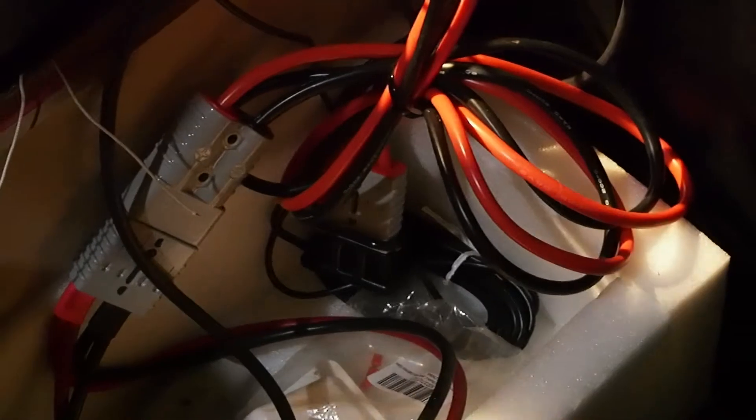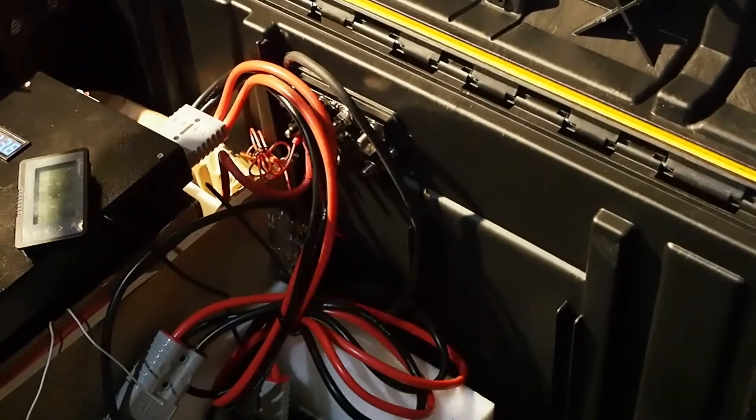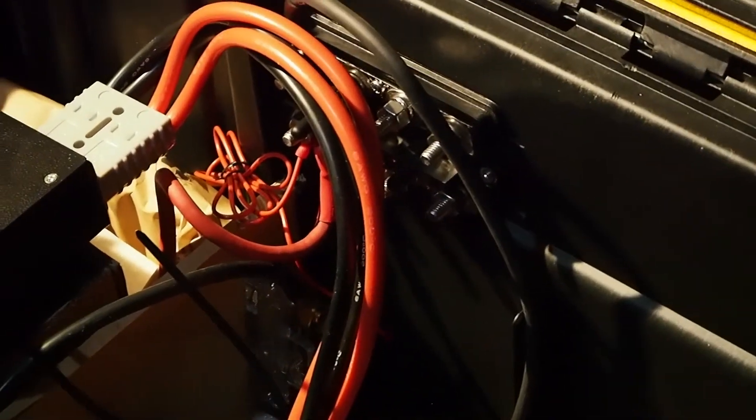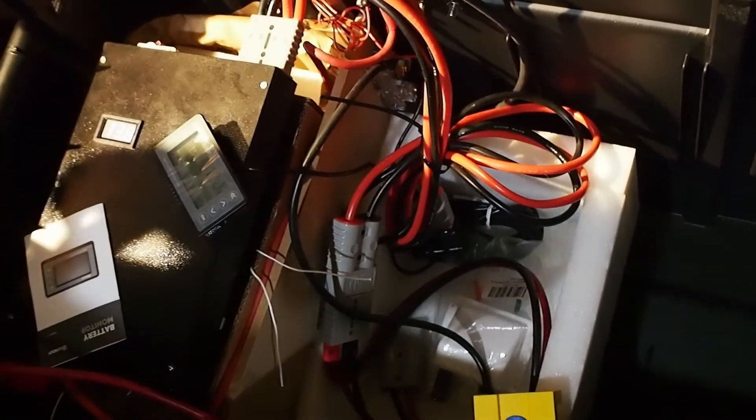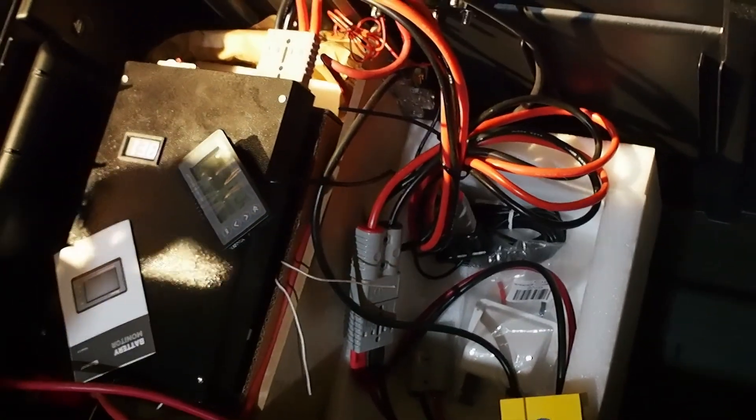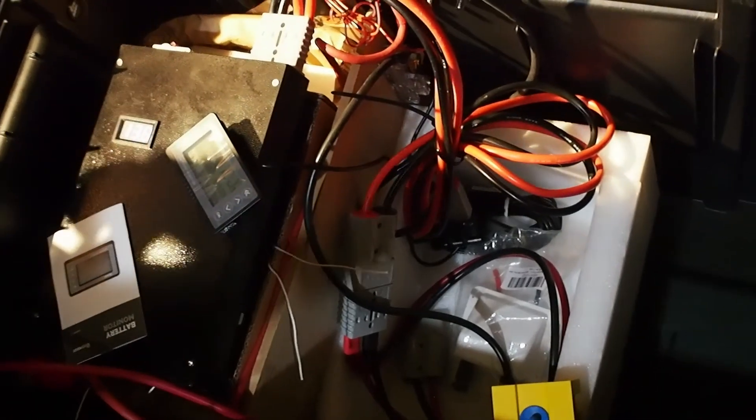That's all we wanted to do — explain how we have the bus bar active now. The battery is active and going to a master switch, so we have total control of the whole unit, turning it on and off. We have an ample bus bar that can handle up to 250 amps, and the BMS can steadily deliver 200 amps out, no problem. Thanks, and you guys have a wonderful day. Don't forget to check the links below, and if you can help, follow that link below. God bless you.